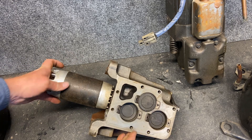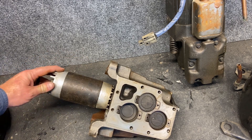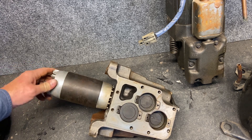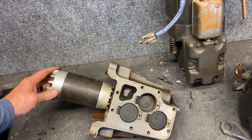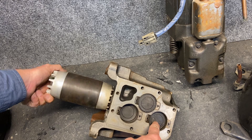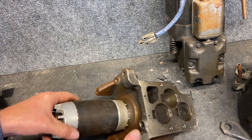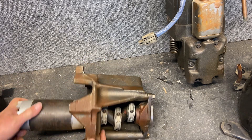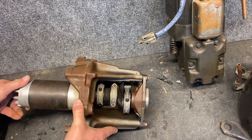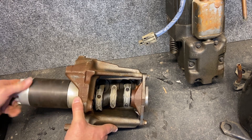This is our head plate — we're discharging gases out through here, and we also have the suction plate where it's pulling suction gas in. This is the rotor that rotates; the magnetic field causes this to rotate. As this rotates, it makes these pistons go up and down — this back and forth movement is the reciprocating action. This one has three different pistons, which makes it quite a large compressor. In the back you can see the crank system. These pistons moving back and forth in that reciprocating action is why we call this a reciprocating compressor.